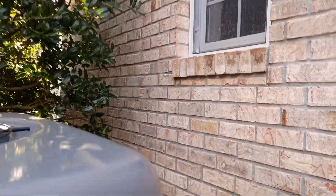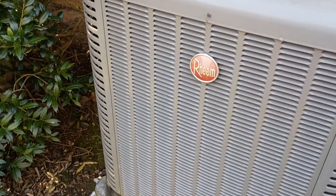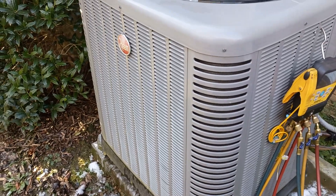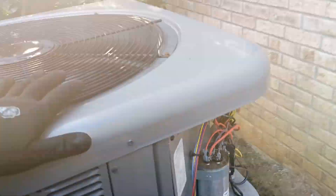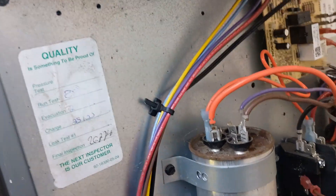I'll just get up here and let you see this thing - the new pretty style of Rheem. Got your big round red badge there. These things rattle a lot. They had a few little issues: some pressure switch issues, mainly that high pressure switch cracking and going bad.